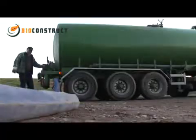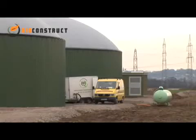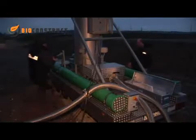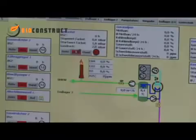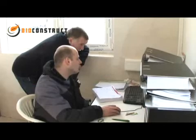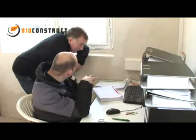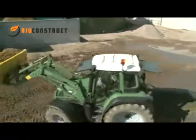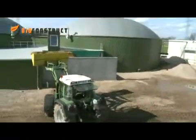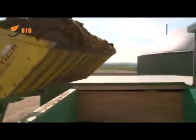The fermenters are filled with liquid manure and then heated using a mobile heating system. Biogas production begins. Until the methane content is sufficient to generate electricity, any gas produced is burnt off using the BioConstruct gas torch, carbon free. All data is centrally collected and analyzed using PLC control, and all the important plant components are also automatically controlled. The maize silage is fed into the production process; the buffer volume of the floor discharger means the plant only has to be filled once a day.